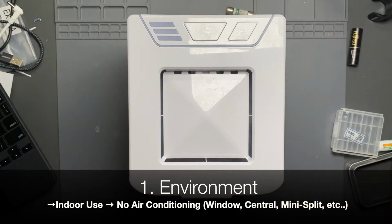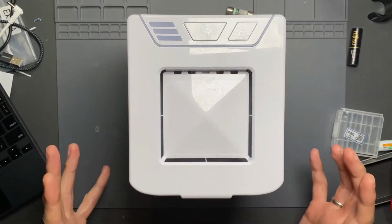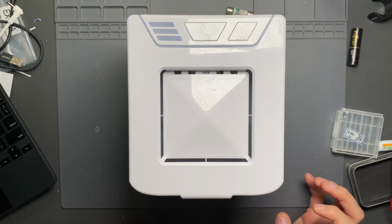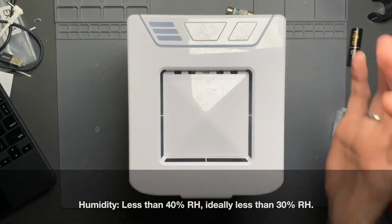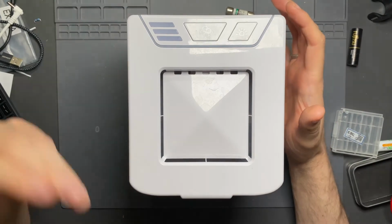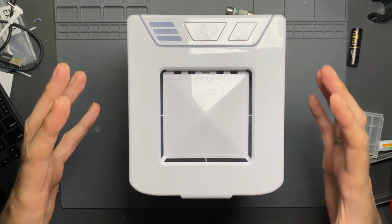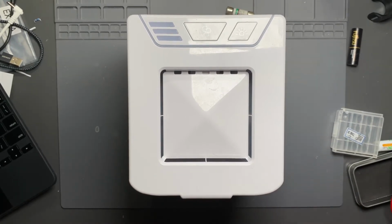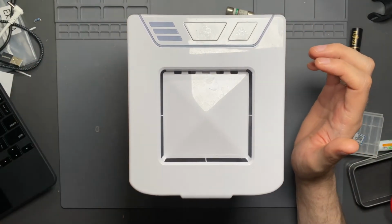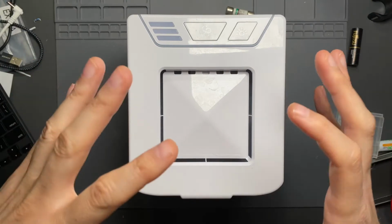So if you have no air conditioning, the conditions for when you would use this in an outdoor environment also apply to that particular indoor environment. That is, you want to really have low relative humidity in the area that you're in, both outside your home and inside your home. To have a moderate to high level temperature that you're trying to bring down, or at least affect a particular area in your home, apartment or condo, whatever the dwelling is, to bring an area of that down to a cooler temperature. If it's a coolish temperature, 75 degrees or so, and you're trying to get it down to 68 or 65, this isn't going to work, because the limitation of their cooling efficacy drops off significantly at around 70 degrees Fahrenheit. That's if you're using this in an area where you don't have air conditioning.